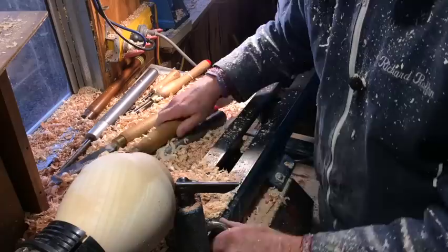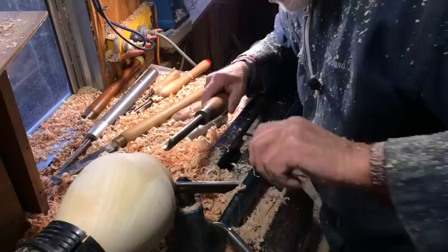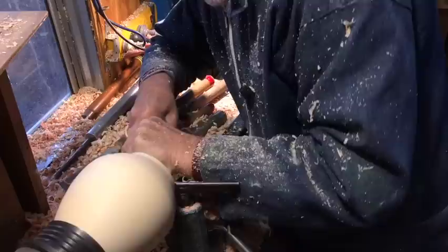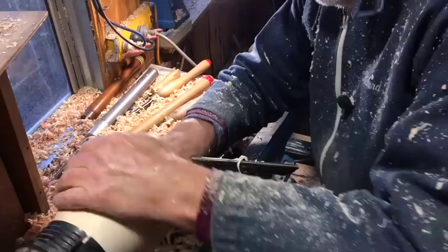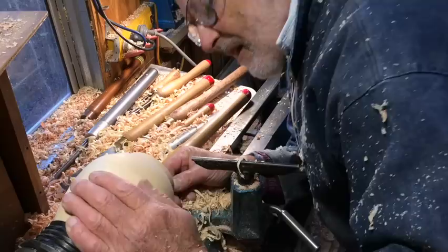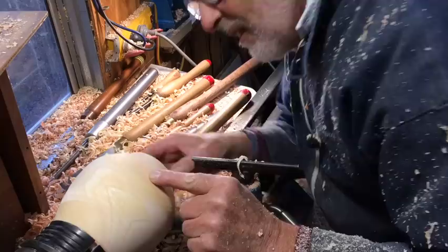Drop the rest a bit in preparation for the half inch gouge, that's the half inch flute. And yeah, I can just begin to feel the tool begin to cut in there. Again, asymmetric tool, so it's going to cut pretty effectively with the steeper right wing. Okay, I've got a little ridge around here, and yeah, be okay.